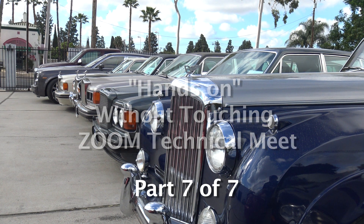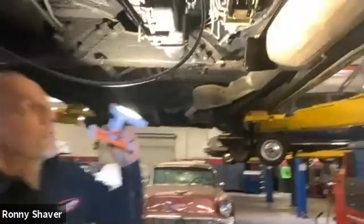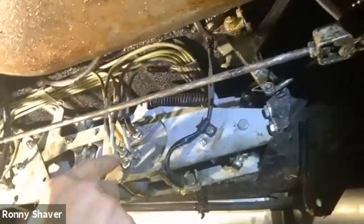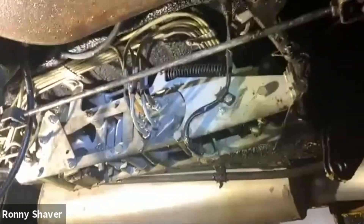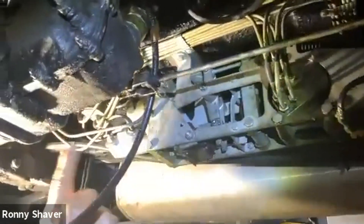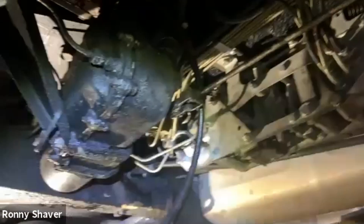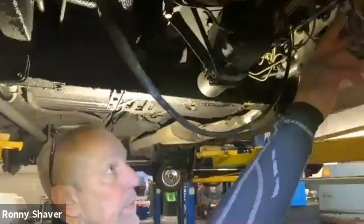It has the brake fluid hydraulic system that runs off of the 363 fluid. There are a lot of brake lines in here. You've got the six going to these. Off the accumulators, you have a flex hose — a high pressure braided flex hose — that comes off that accumulator, goes to the body, and then runs over to here. Actually it goes to a T, and it runs over here, and then the number two system will T also, because it has a feed that goes back to that height control solenoid. So there's high pressure there whenever the number two system is high pressure, plus it feeds its brakes.